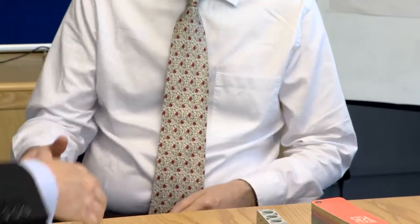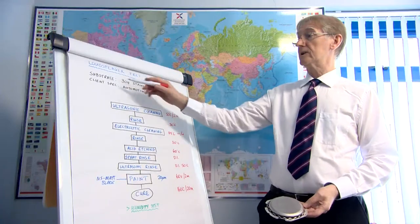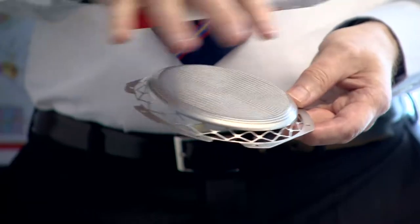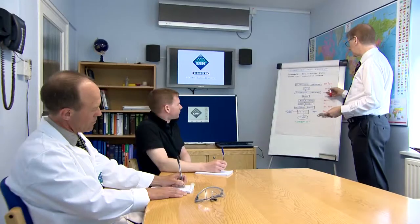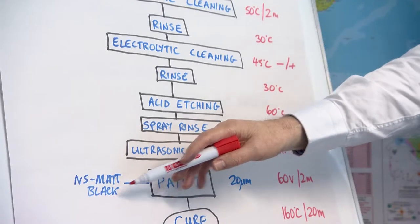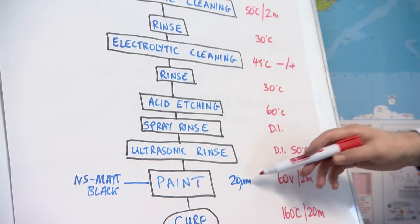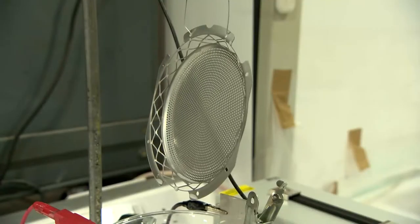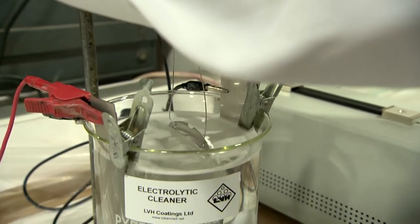Having taken on the project, the LVH technical team is briefed on the client's requirements. The client has a demanding automotive performance specification to comply with. This will include challenges such as humidity, abrasion and chemical resistance. To design a suitable electrophoretic painting system that delivers the necessary appearance and performance characteristics, we have to take account of the nature of the base material and select appropriate and compatible preparation processes.